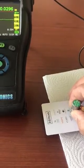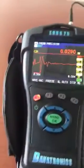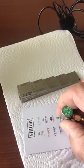Now I'm going to remove the shim and put it over paper, and you'll see the alarm condition occur because the plastic shim is a higher acoustic impedance than that of paper or air back.